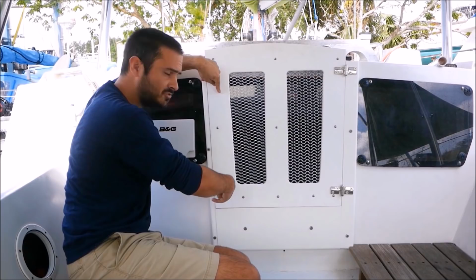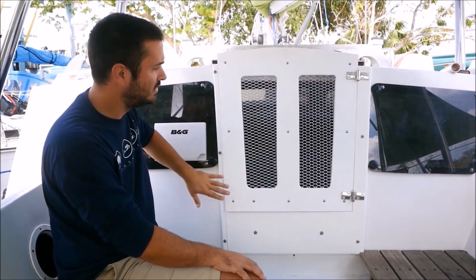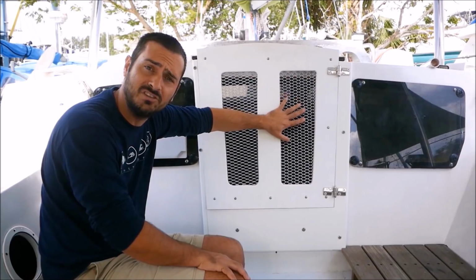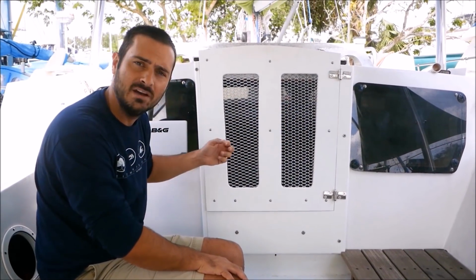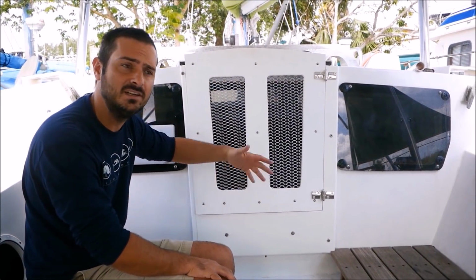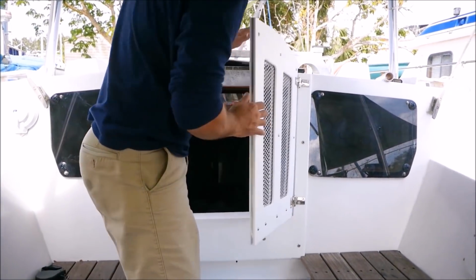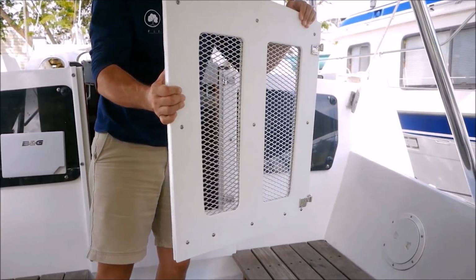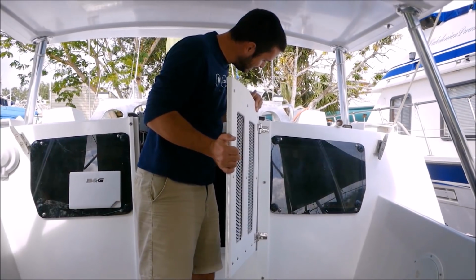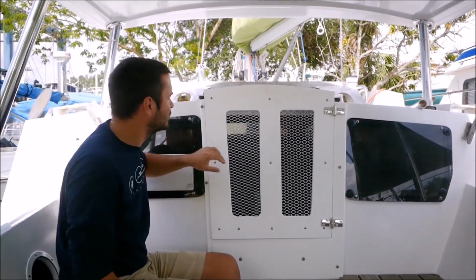We're going to put 2 hatch pins here to hold it into place that we can open from the inside. And then the inserts, metal inserts, they will have a screen as well, a mosquito screen netting to them. And then we have Lexan that's going in place, so we can pull these out, drop in the Lexan boards as needed to give it more of a watertight type of setup. But again, it just pulls out, remove as needed, so we can store it, drop back into place. And it's good to go.